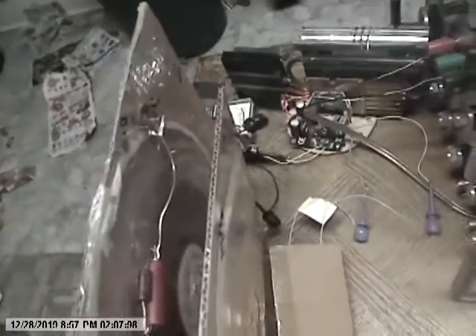I'm not using this coil. I am using this one. This one here is my resonator. This one and this one are wired in parallel. I've got the cap across the input of the one — it's my resonator. It's tuned for around 1.1 megahertz.